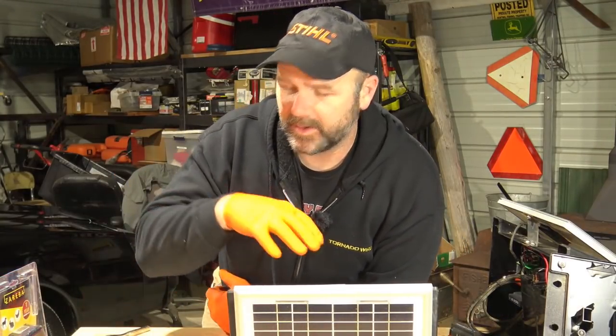I hope you learned a little bit about fence controllers and what you need to think about with them. If you have power at the place where you're doing your electric fence, I would definitely use one that you can plug in. If you want less maintenance for a rural location out in the middle of nowhere, I recommend one like this with the solar panel and battery setup. Also, the fence controller that works on DC voltage — you can hook a deep cycle marine battery to it and it'll run for weeks and weeks. Just check it every so often, and if you need to charge your battery, bring it home, charge it up, and set it back out — should be good to go for another month or so.